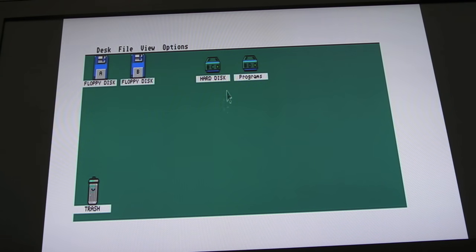With the termination resistor added to the SDMA chip, it's absolutely rock solid. I can run this at 100 MHz for an hour and it's solid. The temperature is a good 10 degrees cooler than it was without the fan. I wouldn't run it at 100 for any long period though — generally I've stuck this at 70 MHz, and that's what I've been using it for the last three or four weeks.